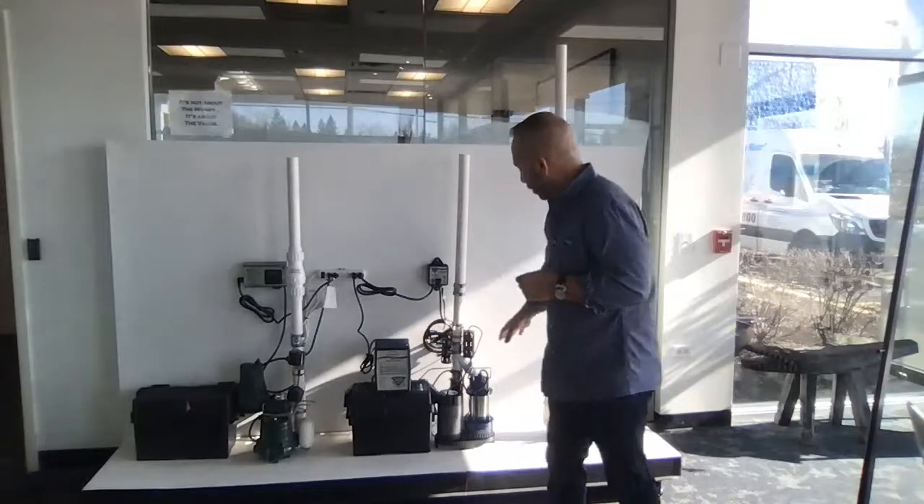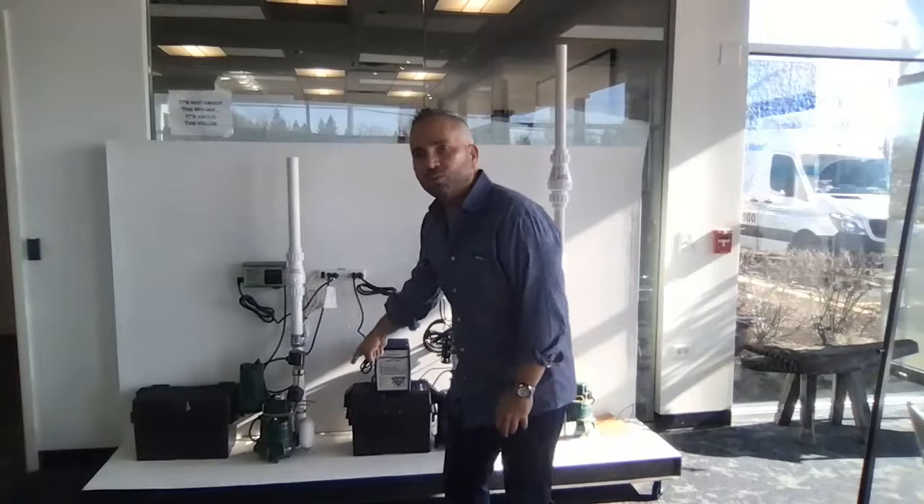Speaking of metal, what's nice about the Pro Series is it's stainless steel, which is great for people who have water softeners. Older water softeners dump salt into the sump pump pit during a cleaning cycle, and salt eats metal. Stainless steel tends to last a lot longer, while cast iron ones tend to get pitted out. That's why we talk to our clients about having high quality water softeners with zero chloride discharge, so they don't ruin this system — the salt can ruin it.